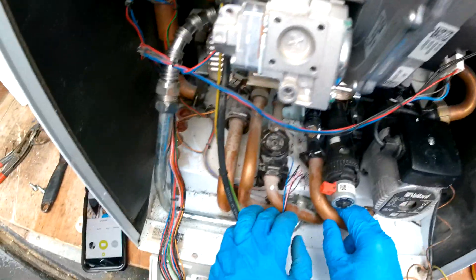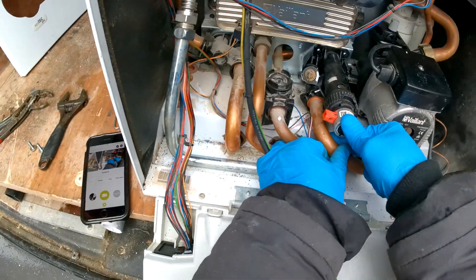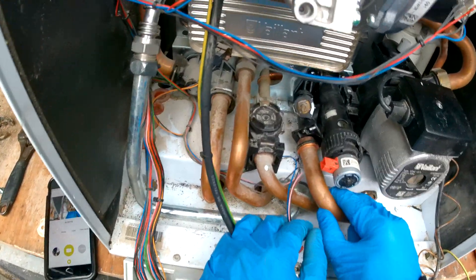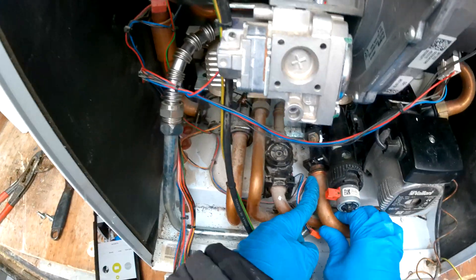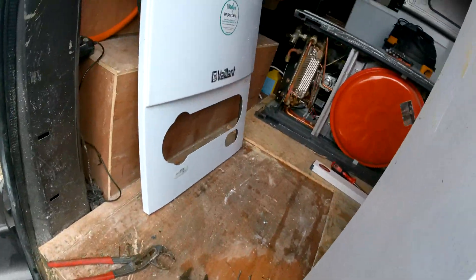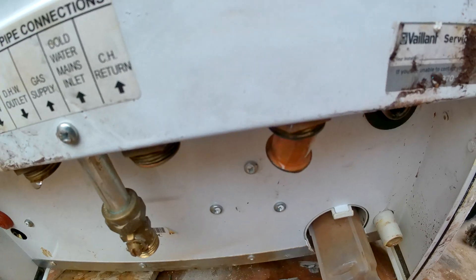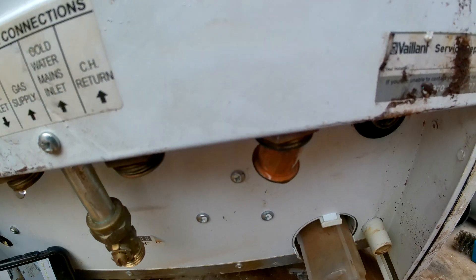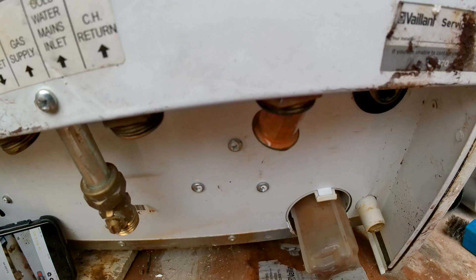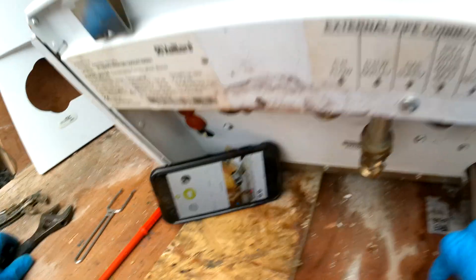You'll notice that when you try to take this out, it's going to be quite stiff. If it is too stiff, what you can do to give yourself a little more slack — you won't need to drop the boiler down — is just look underneath. If you take a look at that nut right there and unloosen that nut, this pipe will go a lot more loose. I'll show you.